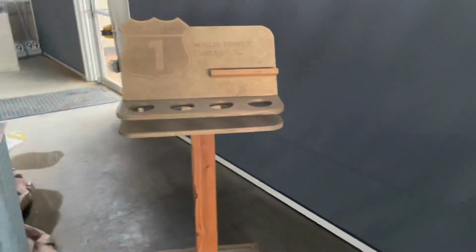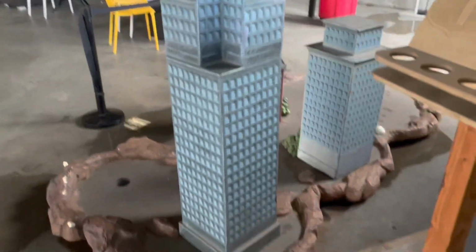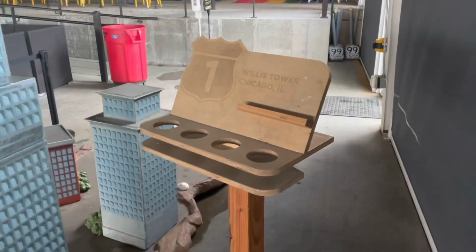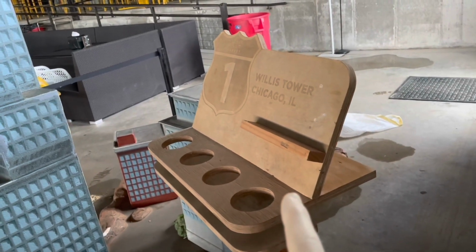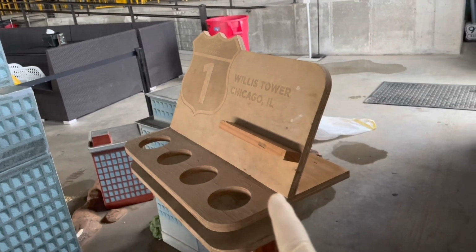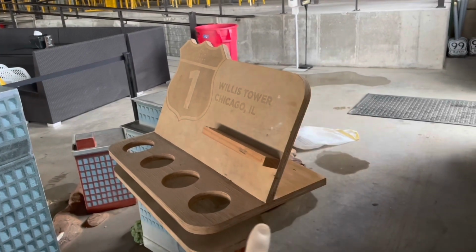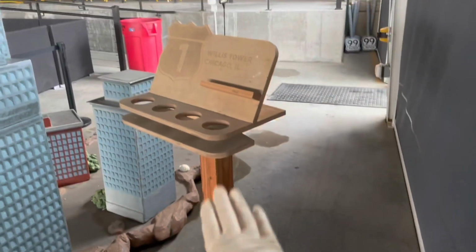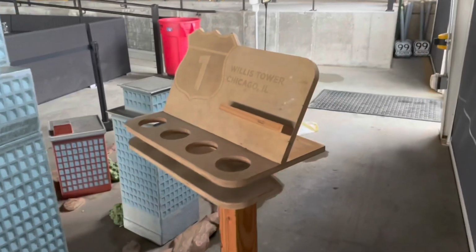They're made out of plywood, and again, I don't know who the original artist was, and I don't know if the same person built these podiums that built the holes. I'm just fixing somebody else's work here. But I did have to fix one of these that had broken. Essentially, they had used uncoated screws here, and the sweat from the drinks had rusted through all of the screws, and then this flap just fell over. So I just used liquid nails to stand it back up and put some new coated screws through there. Now I'm gonna spray all these with a clear coat, some Rust-Oleum clear lacquer, just to seal them up a little bit better and help them weather the test of time.